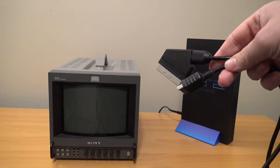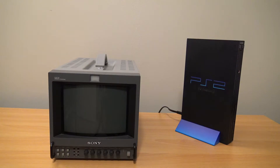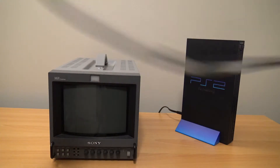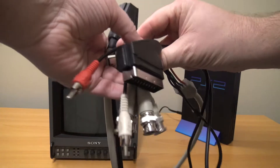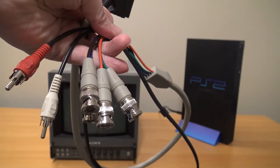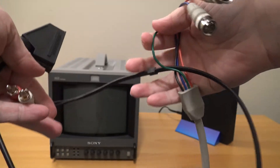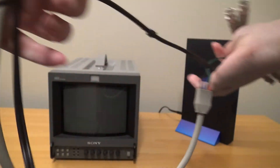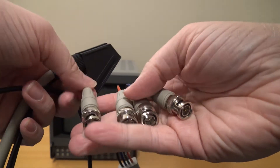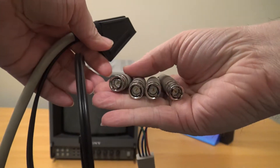So we have my PVM, and like I tried before, I was having issues with my old breakout adapter. For this PVM we will need this adapter. What it does is it converts the SCART connection into a BNC breakout, and then two audio cables — don't worry about those. So it reruns the lines for the red, the green, the blue, and then a sync line for the RGB signal.